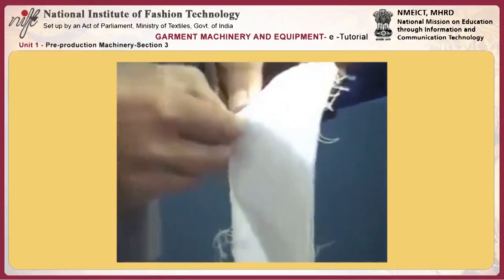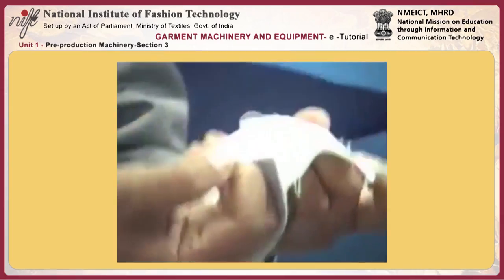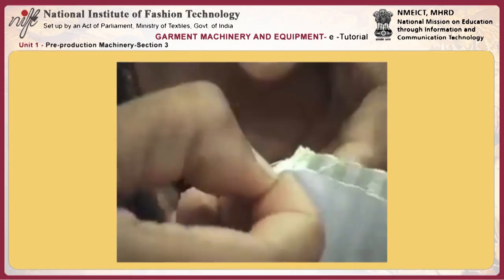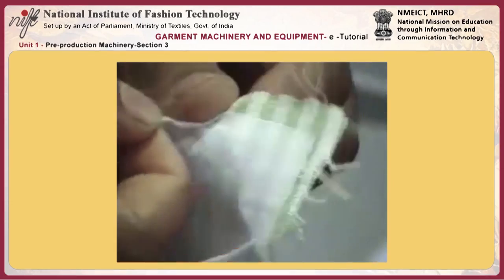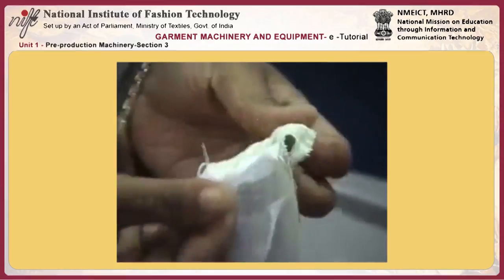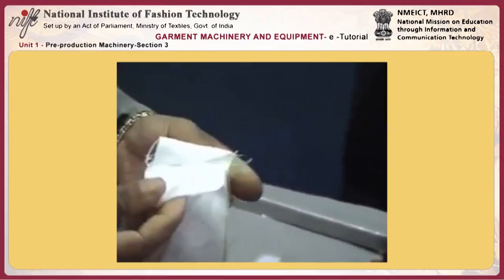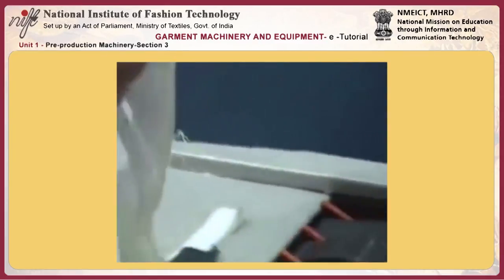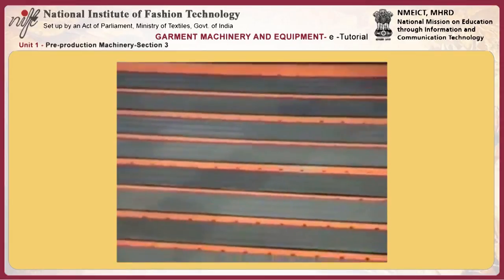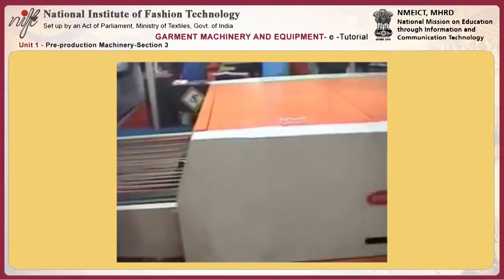We also have a refrigeration cooling in this model. As you can see, it's trying to peel off and you see it is more than 70 newtons. You can see double interlining — we fuse double interlining at one time, and on both you have the micro dot exactly on the fabric as well as on the interlining, which is perfectly alright. We have actually done it at 175–170 degrees at the pressure of 5 bars with two interlinings and perfect results.